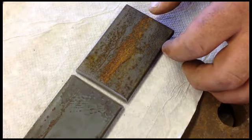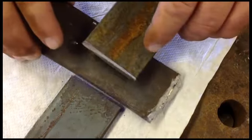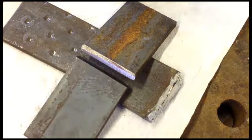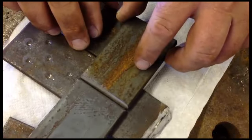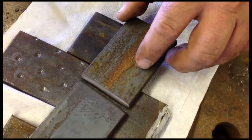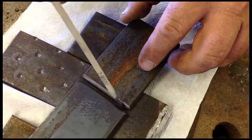You will have a backing plate on your material which will allow you to burn through and get full penetration. As you set up your backing plate, same concept — the 3/32" rod gives you your gap.